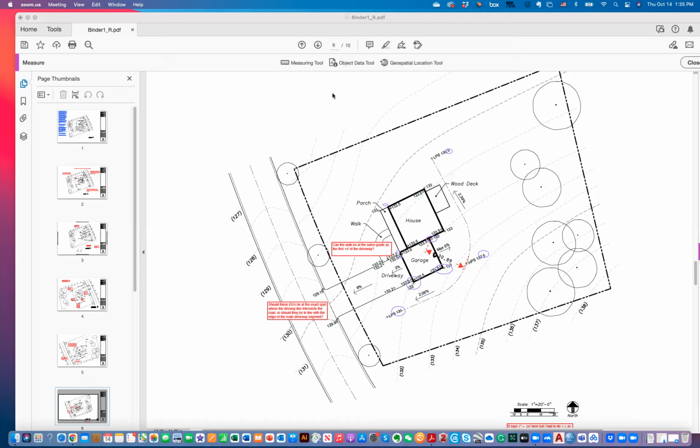All right. Just to keep things simple, should I raise the spot elevations on all the corners up to 133.5? Or should I just do it in those critical spots? I think you should just do the further away one, this one. Okay, copy that. These ones it's actually good if you can lower them. You're facilitating the water to go to your swale, right?